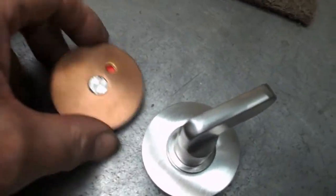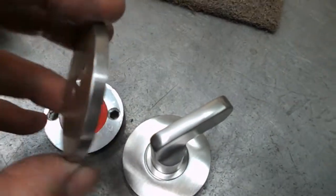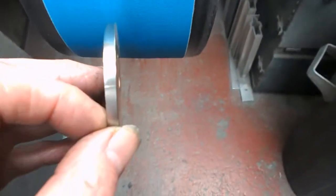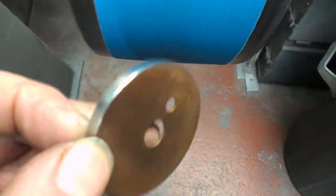We've got the same thing going on with these. Around the edge we couldn't do it on the Scotch-Brite — it would not touch it. So we've got an abrasive band set up, zirconium grit 240, and that's got around there and cleaned it up.